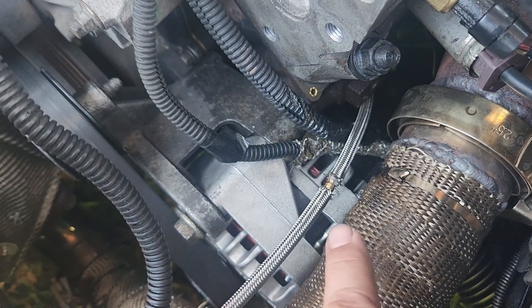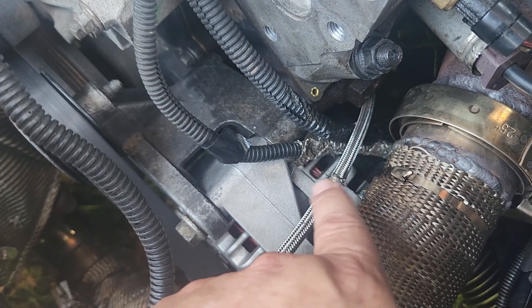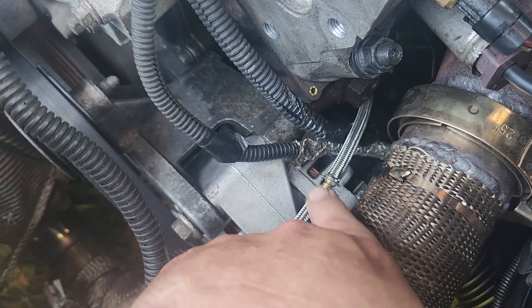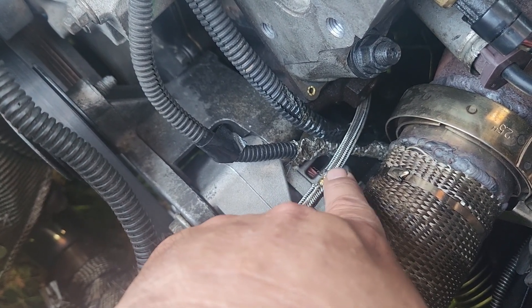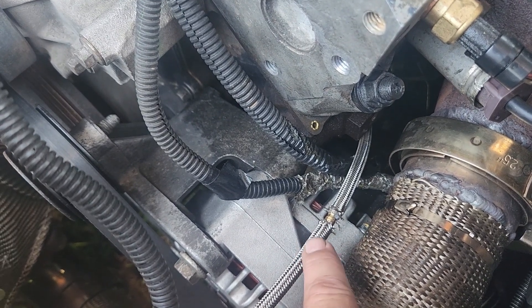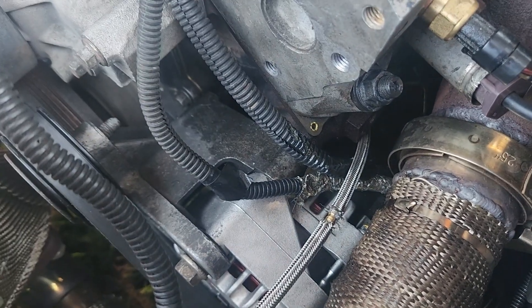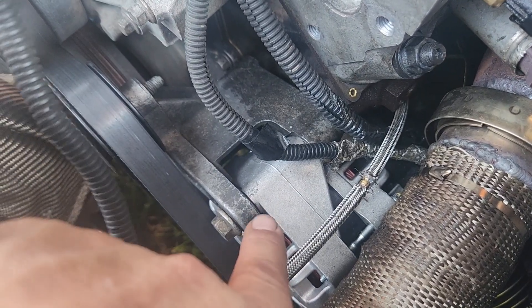It melted a hole in this hose — the inside is like PTFE, like a plastic. I went and got a 3/16-inch barb and cut the burn marks out. It had been burnt twice but only one burn spot was leaking. I cut those out, put the barb in, and it's not leaking now. I'll probably put some screw clamps on that. I did order another one but I'm gonna keep this one as an emergency spare.